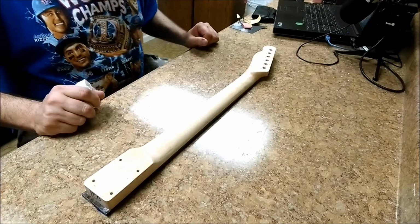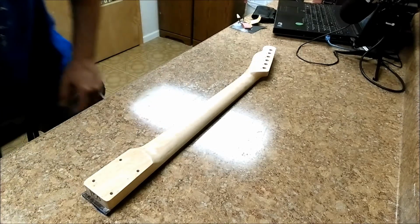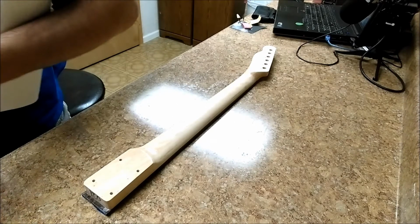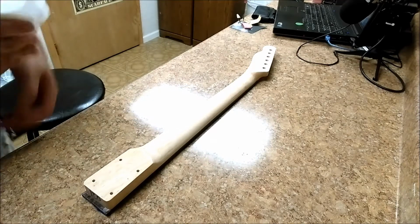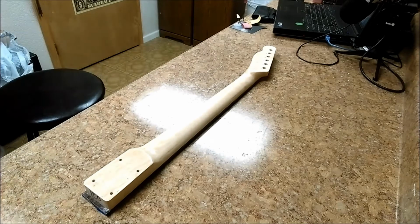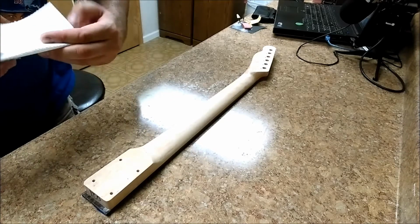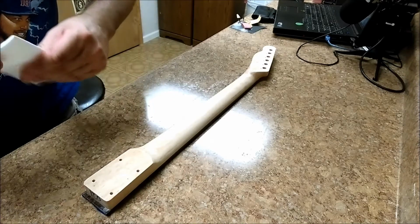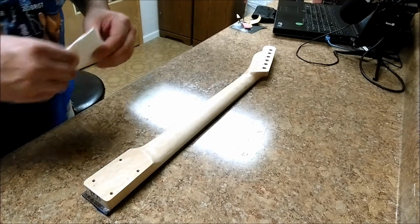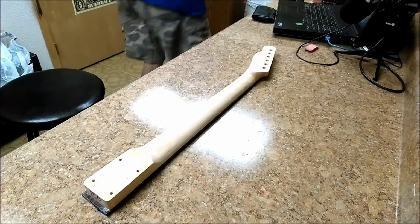So next thing I want to do, wipe on poly. Yeah, wipe on poly. I know, you guys are sick of it. Poke fun of it all the time. But you know what? It's not bad stuff. It actually works out pretty good. So again, I'd rather use a paper towel than a cut-up t-shirt. That's basically recommended to use for staining. And there's less lint in this paper towel than there is in a cut-up t-shirt. So let me get rid of the used sandpaper.